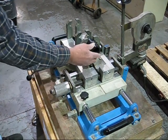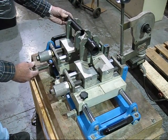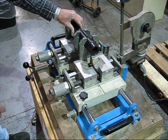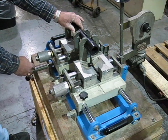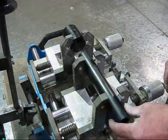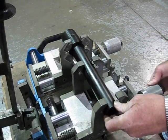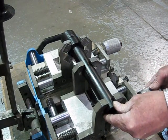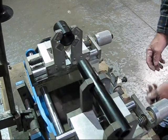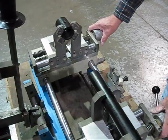With this tightened down, it will not move. You insert your pipe — or have it already loosely fitted into your clamps. You bring this forward until it breaks the plane of the fitting. As you bring your pipe forward, you want to just break the radius of the fitting, then tighten it down. Now you can open up your blocks, and you are set with the correct depth in which to make your joint juncture.